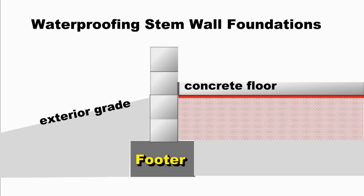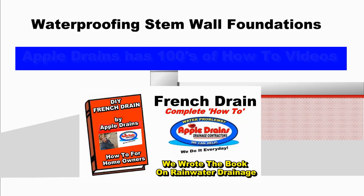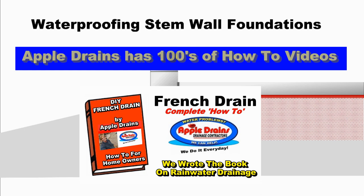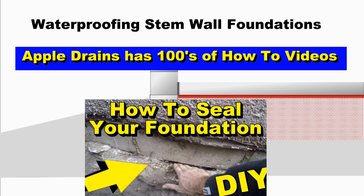So how do you correct this problem? How do you stop that water? Right now, there's no place for water to go. If we install a footer pipe — some people call it a French drain — it's actually perforated pipe surrounded by gravel set at the footer level. It has to be down at the footer level, below that floor. Without the footer pipe, there's no place for the water to go, and hydrostatic pressure begins to build and pushes up through the concrete floor. The footer tile removes that water. If you're ready to tackle this installation yourself, take a look at some of the footer tile installation videos — there are truly hundreds of them, and we solve this problem every day.